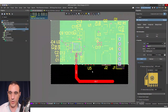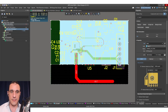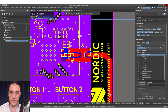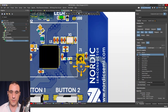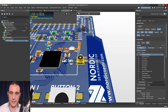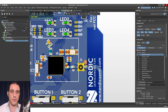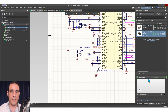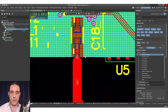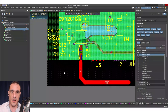This was just one of the antennas copied over from the reference design, but there's still another antenna option from J1 in this layout. Looking at this in 3D, you can see that J1 is a coaxial connector. This would actually connect to another antenna — like a rubber ducky antenna or a coax connector that then connects to another patch antenna. You have the option to add that in just by copying these two components into the schematic, putting them on this net, and importing them. You could just place them right here, the same way as in the reference design.